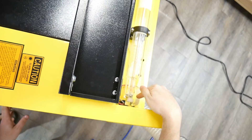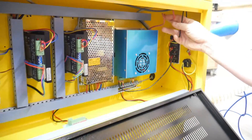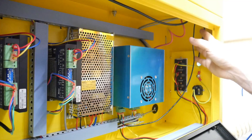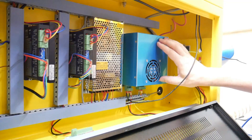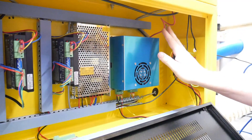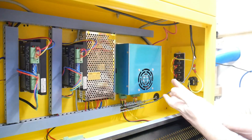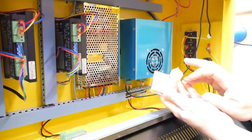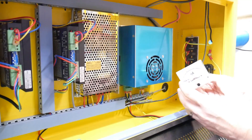We're at the laser following those wires down through the channel, coming on to the side of the panel. This is where the laser is and the wires are coming down. We're going to open the side panel. Our wires are right here — we have the big thicker red, that's the positive, and then the thinner black. I have a second black one here, but I added that — it's the USB cable for the camera for our software. This is going to the box which is the power supply for the laser alone. The other box is the power supply for all the electronics. We have a positive going out to the laser which we're not going to touch at all. We have this negative, and we're going to have to splice into this wire. We'll make a cut, attach a wire to one side of the milliamp meter and a wire to the other, splicing in and back out, so it runs in series along this wire and gives us milliamp readings.